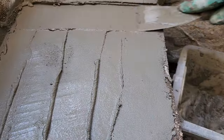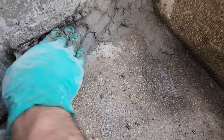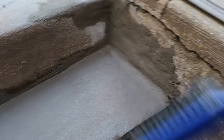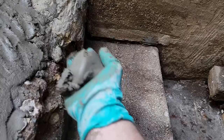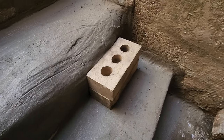So how does that look? I kind of love it. When doing deep fills like this, do it in layers — apply about a quarter inch to a half inch at a time, let it set up, and then build it up until it's level with the surface. This started to sag a bit, so I supported it using a couple of bricks. After it dried I gave it a final smooth coat.